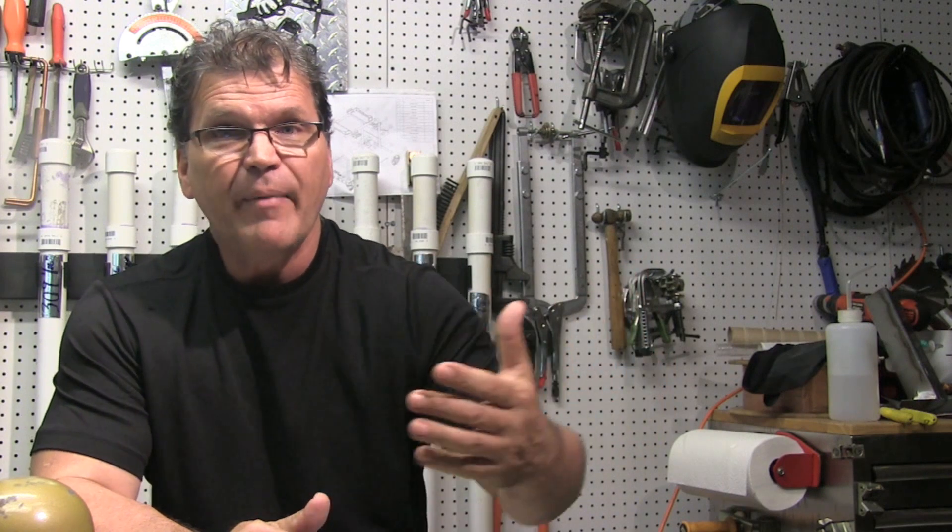It depends on what you're going to do with it, what kind of power you have in your garage or your shop. So I want to kick off a little series here talking about several different TIG welding machines — at least 11 or 12 different ones that I've welded with over the past couple of years. Today I'm going to start by talking about scratch start TIG, the most basic setup, then lift arc TIG with small inverter machines, lift arc TIG with a multi-process machine, and high frequency start DC TIG machines. Next week's video will get into AC-DC basic machines and then full featured machines with AC frequency, AC balance, pulse, and all that stuff.